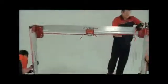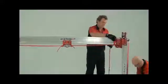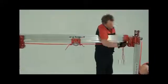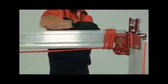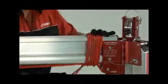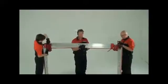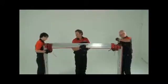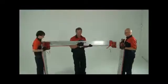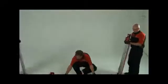While this is being done, center the trolley on the bridge and tie off the guide ropes to the bridge. Finally, remove the head pins from the interlocking hinges to release the bridge from the legs. Your Arachnopod components can now be packed up.